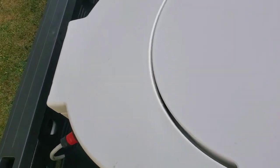This is our Johnson SPX 1000 flow system — our original system with our high-pressure venturi. Here are the 1,300 minnows. We wanted to test whether a 1,000-gallon flow would make these minnows work too hard. What we've actually done is turned our nozzle flat and pointed it up, running most of the current across the top of the tank. You'll notice that school is staying tight to the bottom, resting in the calm center of the tank and moving as a uniform school — they're not really working too hard.